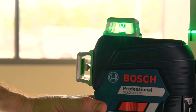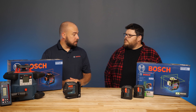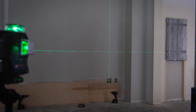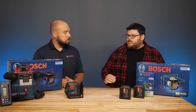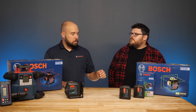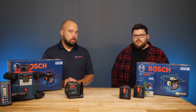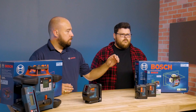And with that, an extended range from 100 feet to 125 foot visible range on these now. The other item we have to show is one of our new alkaline crossline lasers — the GLL 100-40G. This has a lot of the same design points that we saw on the three dot lasers. With the lasers moving towards green, typically one of the issues we had with green versus red was run time. We've been more efficient in how we manage that power and have also added batteries to increase run time. When you get into our three plane lasers and higher end crossline combination lasers, they actually run on the Bosch 12 volt platform — the same 12 volt battery platform that runs some of our drills and other tools. These are dual source; there is also an alkaline battery option.